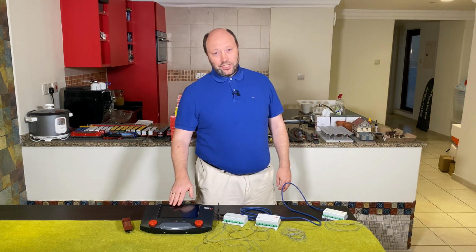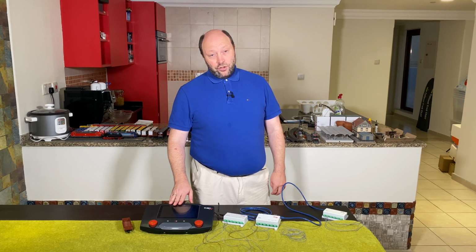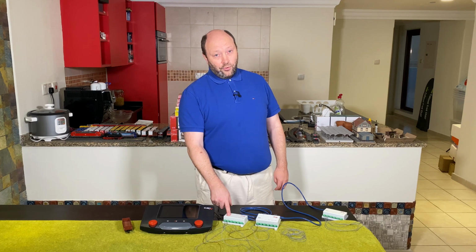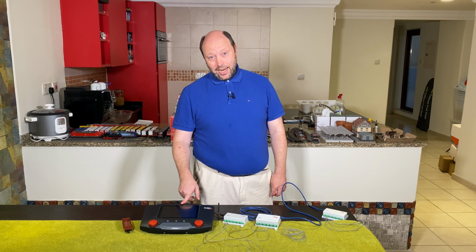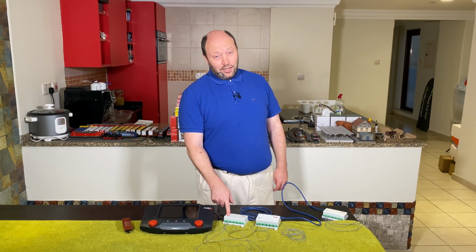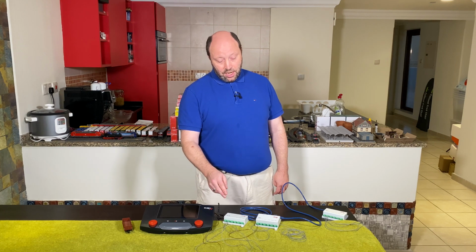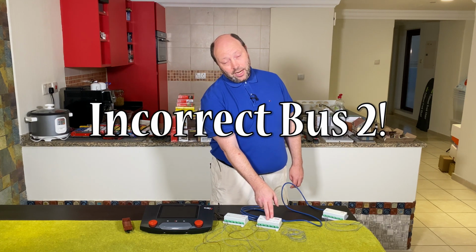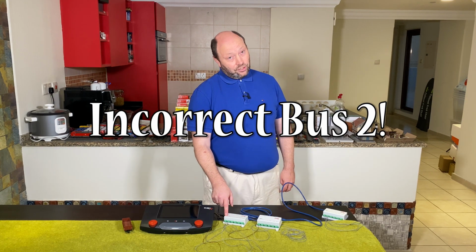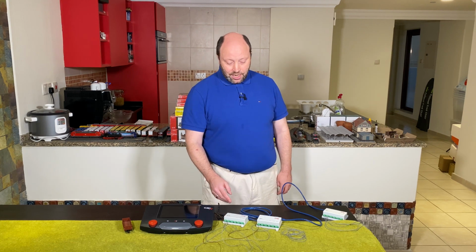Inside the central station tree, you need to make sure that when you make the contacts, you specify, first of all, the correct Link88 or the internal central station plus S88. If you got multiple Link88s, remember to specify the correct one. Then you need to specify which bus it is. So on the Link88, there's bus 1, 2, 3. In this case, the additional ones are on bus 3. There's also a direct you can choose. And then you need to say which of the ports it is.